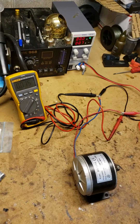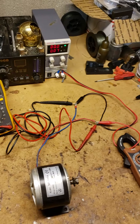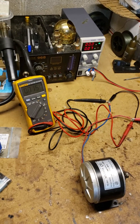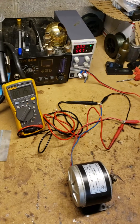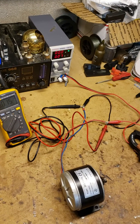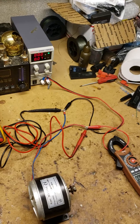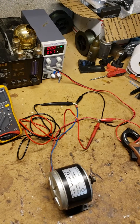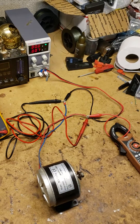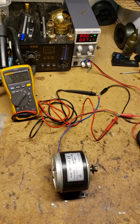Without that droop effect, it basically causes the motor to run harder than it was designed to. Simple Ohm's law supports this: volts times amps equals watts, which is your total power being used. There are rumors going around about trolling motors drawing more amps as the voltage drops, and that is actually not correct - that's why I put together this video.